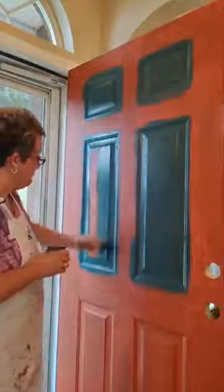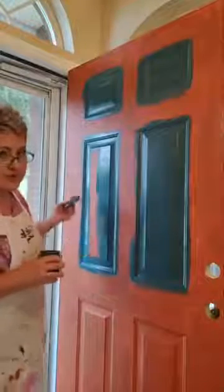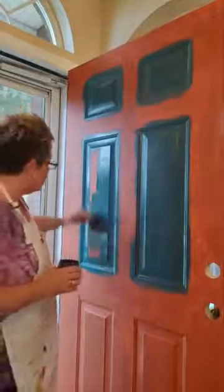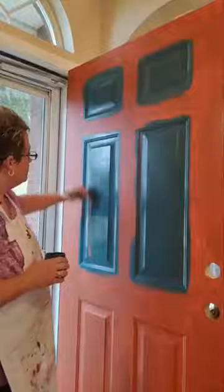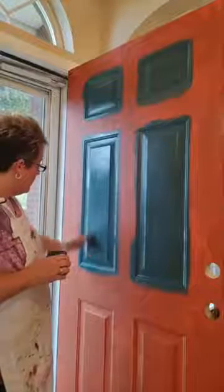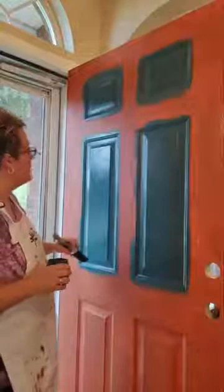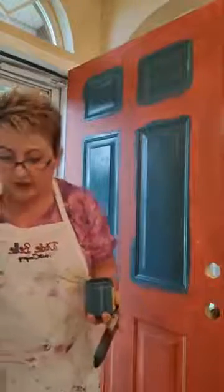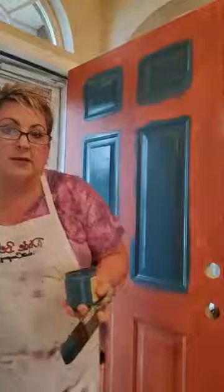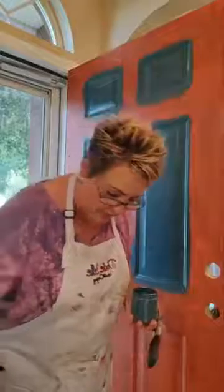Somebody was asking about, did you put slick stick? What's the name of the orange stuff you put on it? Prime Start. So whoever asked about slick stick, I did not. I used Prime Start because this door is metal and it has some pitting, and it's kind of experimental for me. I'm pretty sure that the Prime Start will help prevent the rust from coming through, because it helps prevent the patina from continuing on metal products. So, in a few years, I'll find out. But no, Debbie, I did not use slick stick.